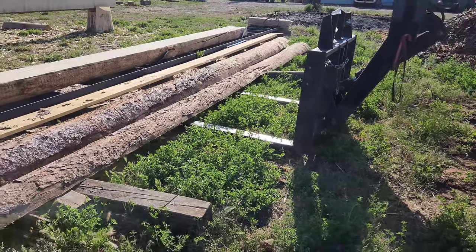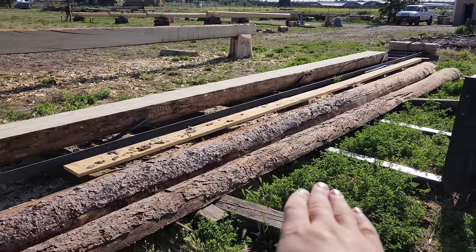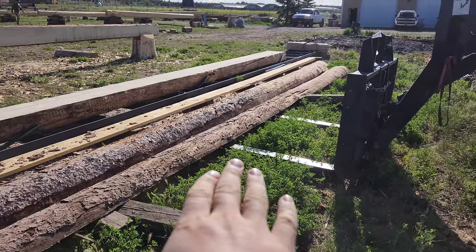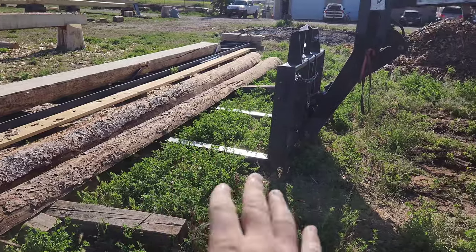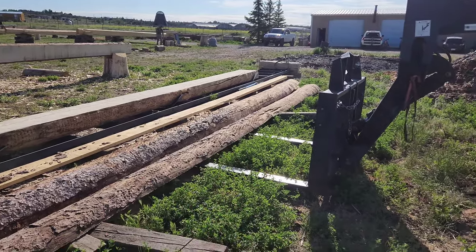The other standard we'll do is whoever's running the sawmill — as you set the slabs off, we're going to try to keep them all laid nicely and not just angled back and forth. They need to all be in a line with each other. Even if we have more than one layer, we're going to keep them in a line.